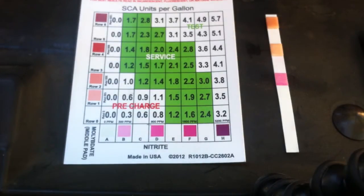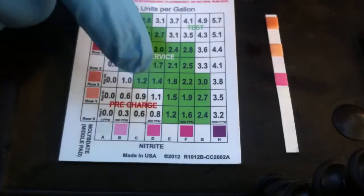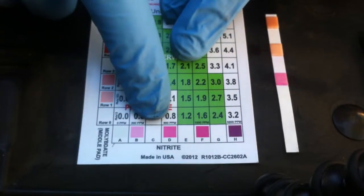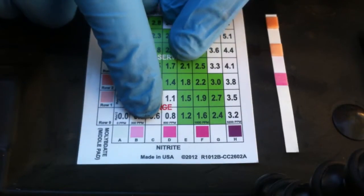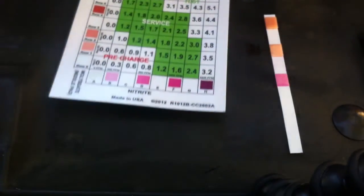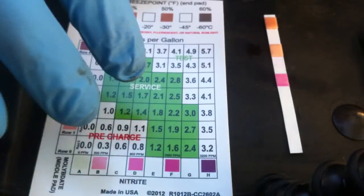So what that means is I do need to add some additive to my coolant. If it's above 800, you're okay. If it's below 300, you need new coolant. If it's between 300 and 800, you need to go buy a bottle of the additive and add that — I believe it's 32 ounces. It's pretty close to 300 but a little bit more than that. I'm going to go buy a bottle and add it. I know it's fresh coolant, so it's probably just diluted — I did have a problem when it got diluted at one point.